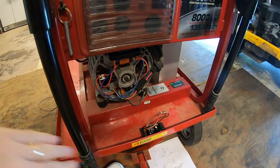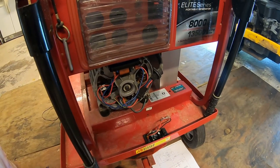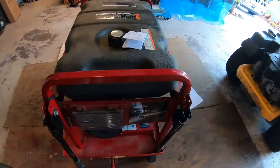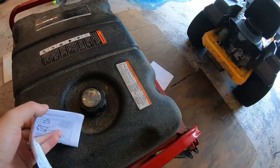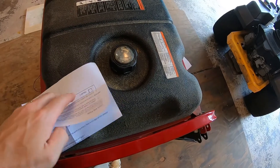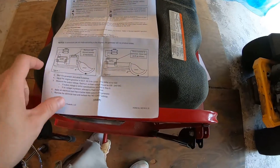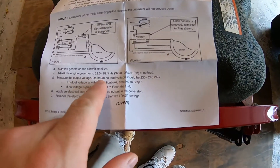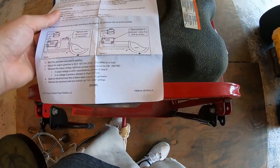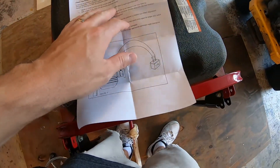Successful repair, I'm happy. I'm just going to button up some of these wires here, make sure that nothing gets caught in any of the spinning components, and we'll put it back together. All buttoned up. And look at that — Briggs & Stratton included instructions. I guess I should have read those. There's nothing terribly shocking in here, only that they said to adjust the no-load engine speed between 62 and 62.5 Hz, which is between 3720 and 3750 RPM at no-load, apply a load, then recheck. I think we're fine.